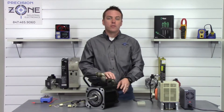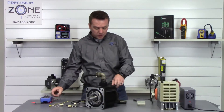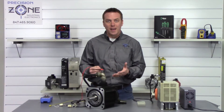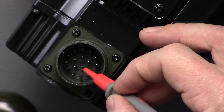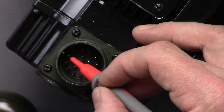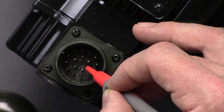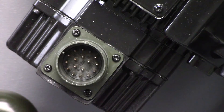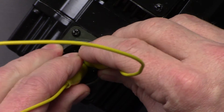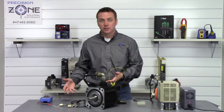You want to go ahead and remove the feedback cable. On this 17-pin connector what we're going to be shorting is R and S — these two pins right here. If you see the keyway in the middle there's a star pattern and the bottom two are R and S, and you can either use alligator clips or a little piece of short wire. The manual says three seconds; I like to do more like 30 seconds.